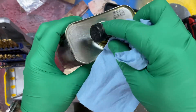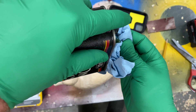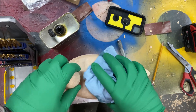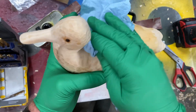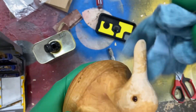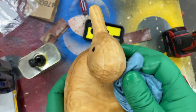With the eyes installed, it's now time to apply some finish so that the final painting of the duck goes well and the paint doesn't soak into the raw wood too much. I'm using some wipe-on poly — polyurethane made by Minwax — with just a disposable shop towel to put it on. One, maybe two coats at the most is all you need here, because this finish's only purpose is to make the paint go on well. Take care to get the finish into all the cracks and crevices around the beak, the base of the head, the neck, everywhere, so there's no chance the paint will find any raw wood and soak into it.